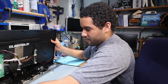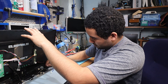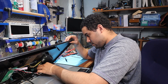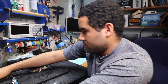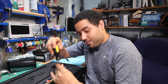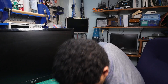Let's pop the hood. The first thing to do is the LED backlight connector which goes here. That's in — pulling those wires through for wire management. Speakers go in like this as we slowly come down. I'm going to put in the LVDS line as well. Everything looks pretty solid — let's put in some of these last screws and pray that this thing works.